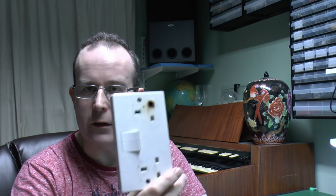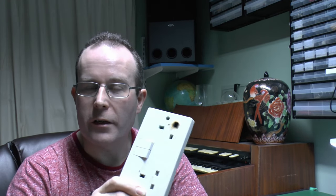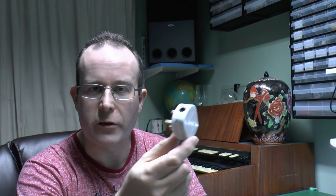So if you find a plug like this is getting hot, or even warm on the back, then there's something wrong inside — probably a loose wire or something — and if you carry on then this is going to be the result, and you're going to have to have the entire thing replaced. And of course if you then take the faulty plug out of here and put it somewhere else, then you're just going to create this problem somewhere else, and eventually all of the sockets in your house will need to be replaced. So just bear that in mind — plugs generally should not be getting hot. If something is wrong, until next time, thanks for watching.